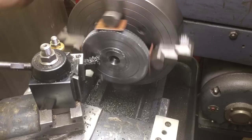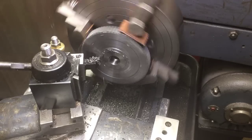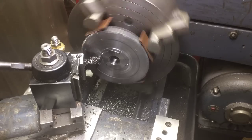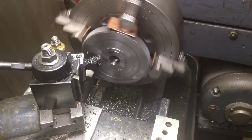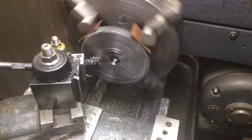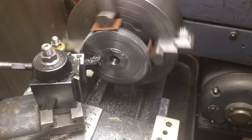It's been slow going here — running at 47 RPM and about three and a half thousandths feed per rev, but that gave me the best surface finish and best cut, so that's the way it is. If I could do this on the big lathe I could probably run it a lot faster because I have a little more horsepower.